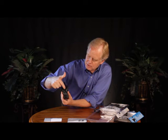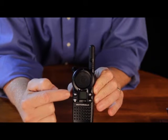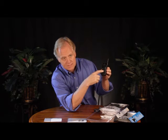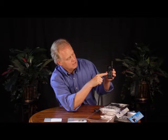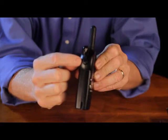When you're looking at the front of it, the first thing you see is the big push-to-talk button right there in the middle. Then you have the LCD display. You have the plus and minus buttons — on the 1410 with four channels, that's how you change between the different channels. On the 1110, you use the plus and minus buttons to program and change the different options. There's also a menu button, a monitor button, and on the left side, the call tone button. On the 1110 you have one tone; on the 1410 you have three tones.